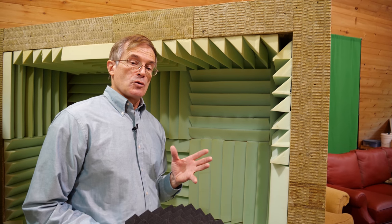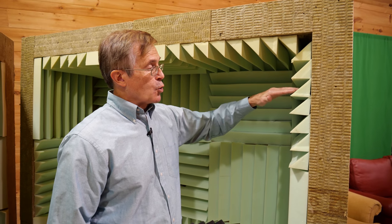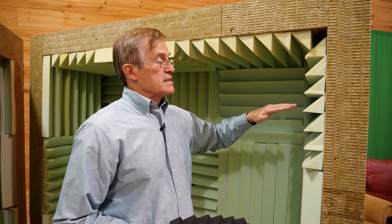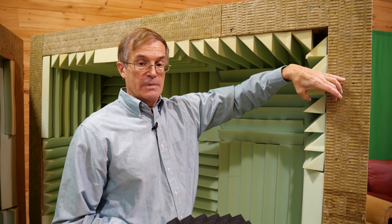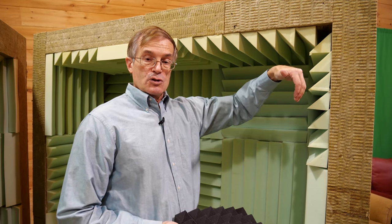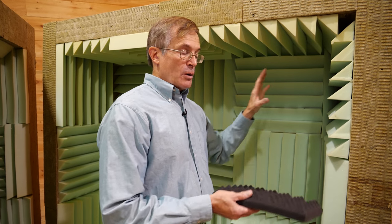The concept of the wedge foam is that it absorbs sound much better at high frequencies than low frequencies. By producing this corrugated surface, sound waves that hit it tend to bounce back and forth a little bit — not trapped, but effectively traveling a longer distance and going through more material on their way into the 75mm insulating pad behind it. Whatever exits the other side, some goes through the MDF, and whatever is reflected back through the panel has to travel through the foam again. The foam then helps distribute that reflected sound so we won't get hot spots.